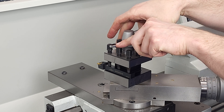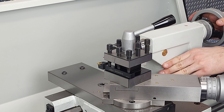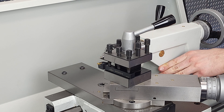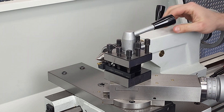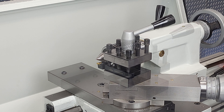I'm putting this threading tool in, cranking down the screws to fix it in place, then scooting the tailstock over to check that the tool is even in height with the center axis of the spindle. As you might expect with no shims installed at all, this tool is quite a bit below the tip of the live center, so we'll need to do something about that.